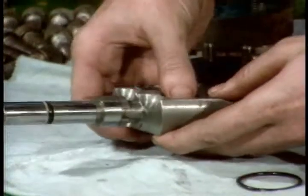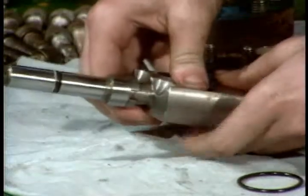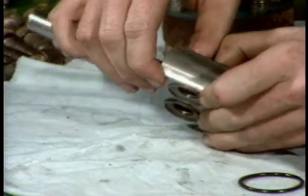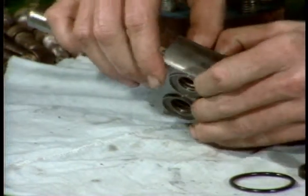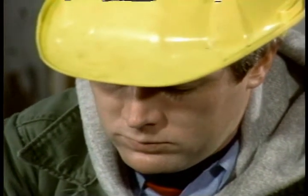When you push out the seal rings, don't use any metal object, not even a brass rod, to get them out. Use your fingers to do the job. Make sure they're coated with hydraulic oil or other light lubricant. This will keep corrosive skin acids away from polished metal surfaces.